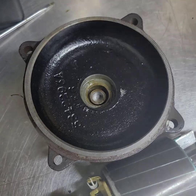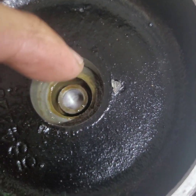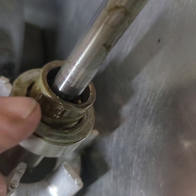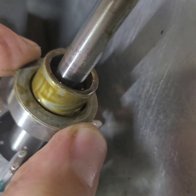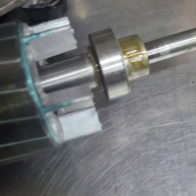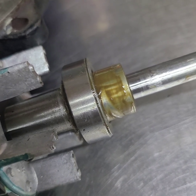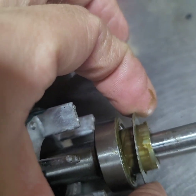You can see this is the front end bell. What's cool about this is you can see there's a little slot down in here, and that slot is actually what mates against this little piece that sticks out here. I guess that's just a way of making a seal. I don't know how tight that fit is — obviously it can't be too tight because the motor has to be able to rotate. But if you put some oil or grease in there to make up the gap, I'm sure it does make a seal. And then we've got the bearing. There's this little flat piece that goes over top — it's an open bearing on one side, and then the inside is shielded.